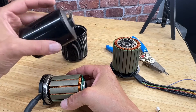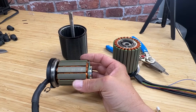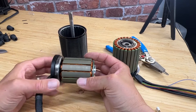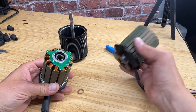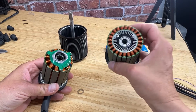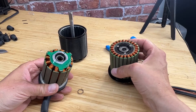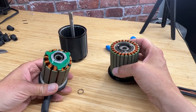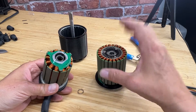Here's the stator of the same motor. You can see what I was talking about before — there's no way to get air into this center area. In fact, this motor doesn't even have a vent at all, so it's going to overheat much sooner. The one major enemy of any brushless motor is heat, so the primary goal with the 6565 Turbine is to get rid of that heat — to keep it as cool as possible for as long as possible so that you don't get throttle limiting or damage your components.